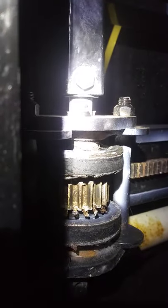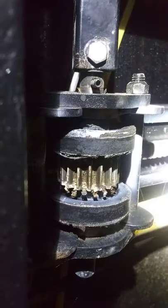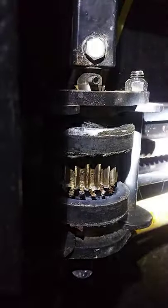Always replace this bolt with a grade 3 — just a light duty bolt. Don't put a grade 5 or grade 8, because the bolt is sort of like a fuse: it's the weakest point and it's supposed to break. If you put a grade 8 bolt in, the bolt won't break — it'll break something else in the gear, possibly breaking teeth off the track. That whole tooth track is welded to the bottom, so you sure don't want to strip any teeth off of it.